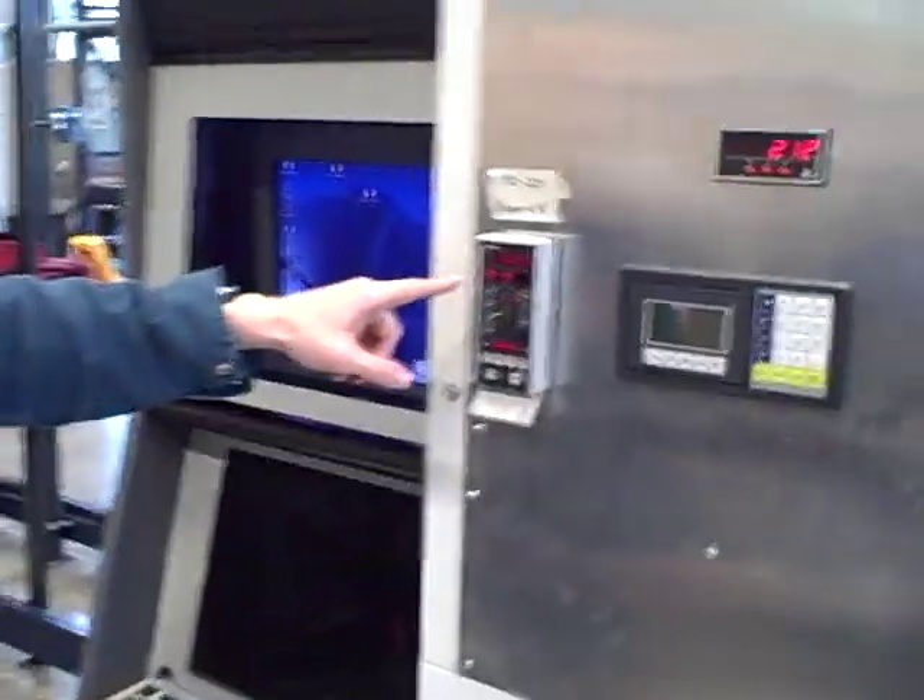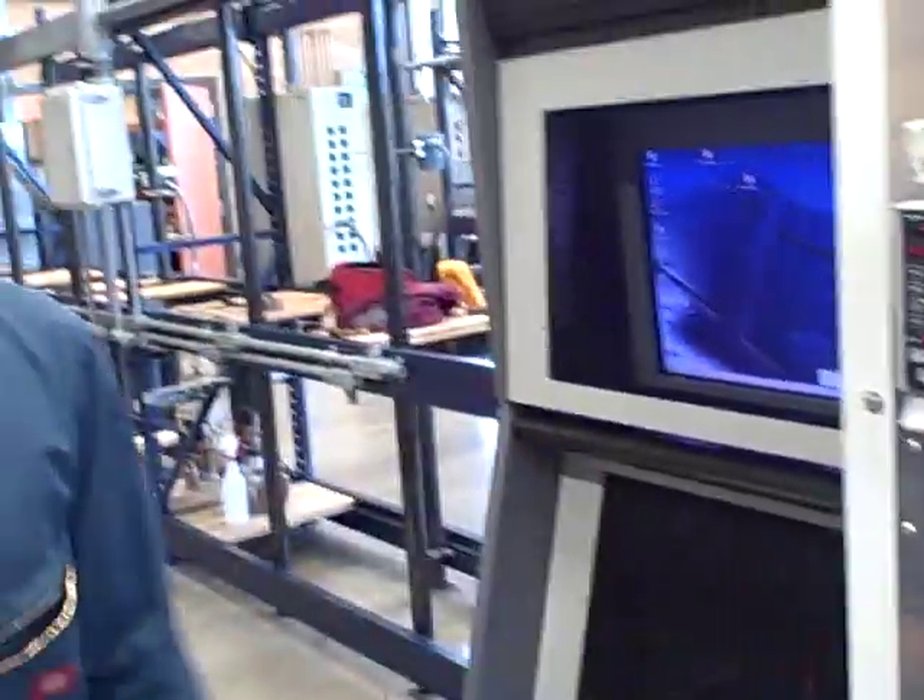Here's the problem. We've got our indicator here measuring minus 50 degrees, and our transmitter is measuring room temperature. So clearly that's not indicating the proper temperature. It should be around 70 or so.